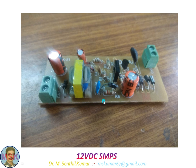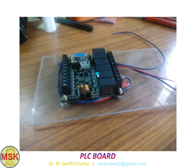This is a 12 volt SMPS. Input is 220 volt AC, and the output is 12 volt DC power supply — because both the PLC as well as the motor require only a 12 volt power supply. This is the PLC I used — it is a 14 MR PLC. It has got eight inputs and six outputs. In this particular project, I required only two inputs: one for the limit switch, and the other for the potential free magnetic sensor. Output one and two are used for switching on the 12 volt DC motor. Output three is used for switching on the LED strip.